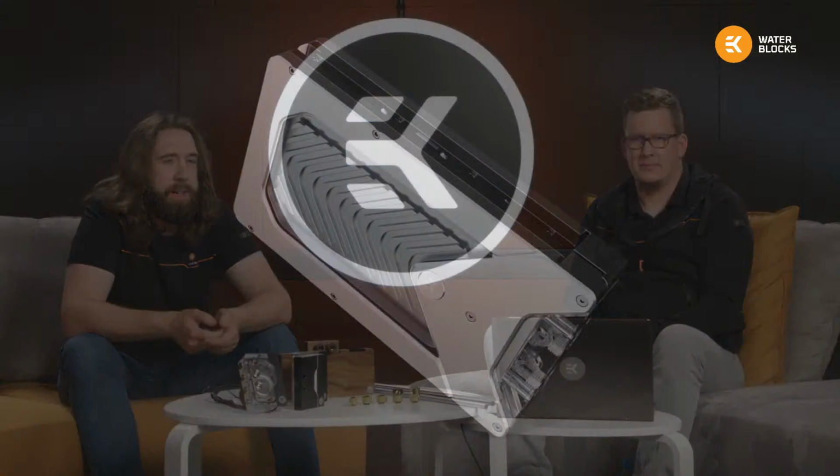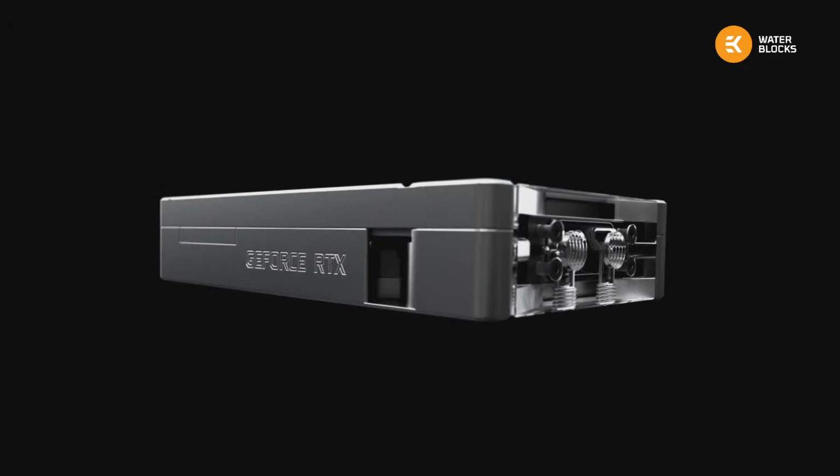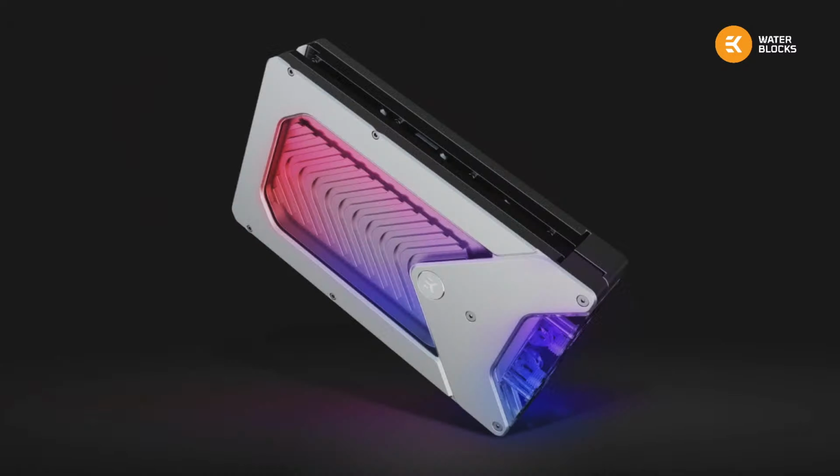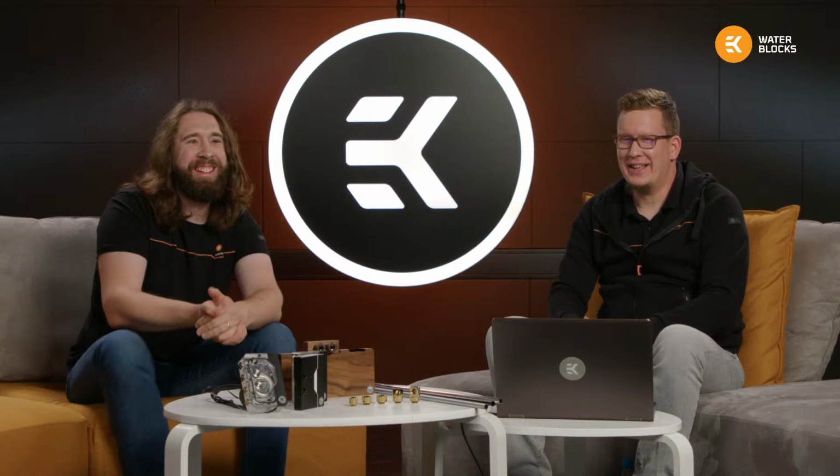This is a really big challenge because the PCB is so small that if we made a smaller block inside it, it would both disrupt the design and not be covering as much as you'd want it to cover. Since the hybrid solution is so good, for the Founders Edition you really don't have any memory junction temp problems there. We chose to go a bit thicker and design the product which everyone would absolutely love if they have the space for it. The overall thickness is still within 2 slots, so if NVIDIA let you buy enough, then you can stick 4 on one motherboard, which I desperately want to see. Yeah.